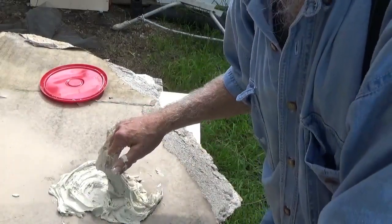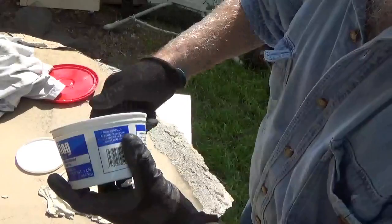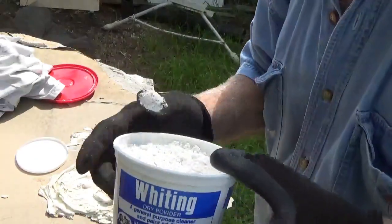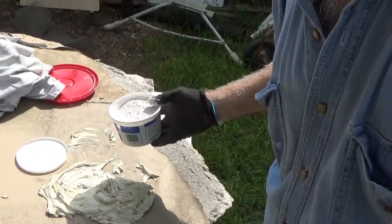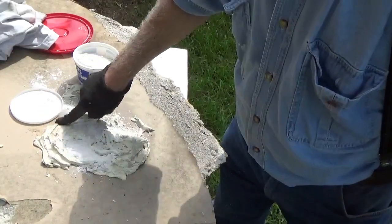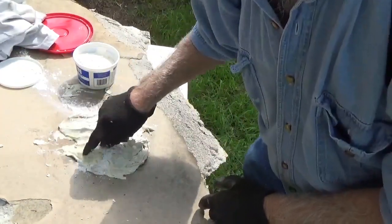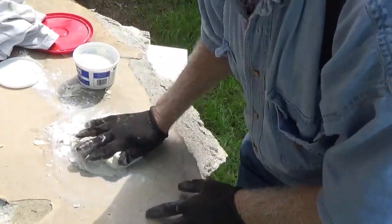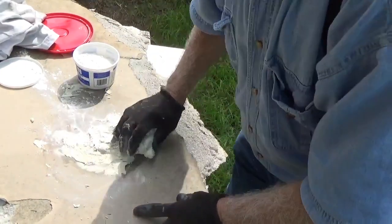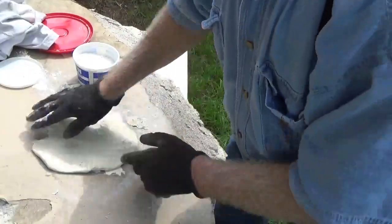There's something I'm going to show you — it's called whiting. It's in the same area as your glazing supplies. You can use whiting to mix in with paint, or you can mix it with linseed oil. What I use it for is when the glazing compound is a little too gooey — you just work a little bit in. You want it pliable where you can push on it and it doesn't stick to you, kind of like baking dough. As soon as it's not sticking to you, you pretty much got it.